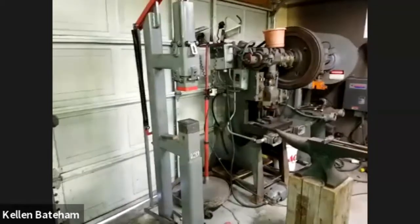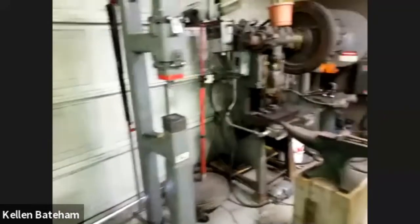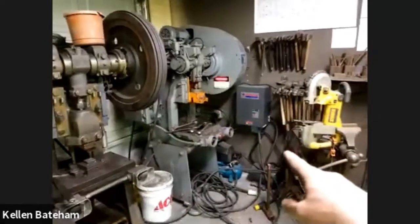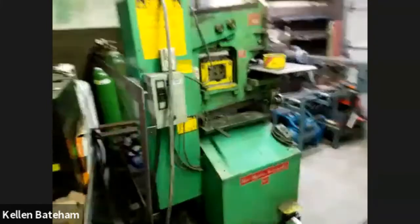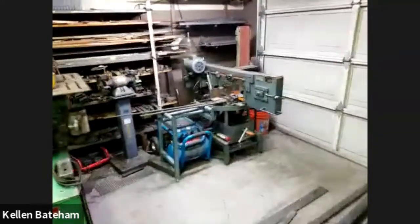See you later. Better view of that Mark Manley treadle hammer. I've collected a few punch presses. This one's a 20-ton. This one's a 15-ton. The 15 I haven't done really anything with, but I'm running a 5-horsepower phase converter to push these machines. This one's a 25-ton punch press that I have used for some things. It's pretty new to the shop though, so I haven't made a lot of tooling for it. Induction forge setup. Iron worker, which is another 3-phase unit that I'm running off of that phase converter, and kind of my fabrication or steel cutting corner. I think that's about it. Any other questions?